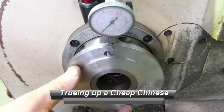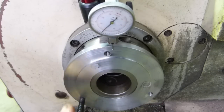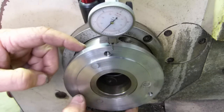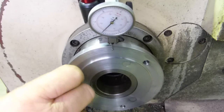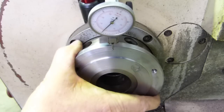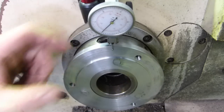We've turned up the boss or backing plate to put the 5C collet chuck on and we're just doing a bit of checking. We put the collet chuck on and had a little bit of run-out, so we're going through it. I've got an indexing mark here so it always goes on in the exact same place, and we just have nothing there — no run-out at all, which is what you'd expect. Half thou increments on this, so that's good. That's what the chuck bolts to.